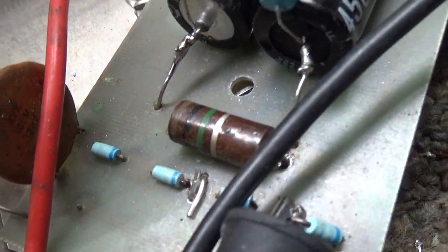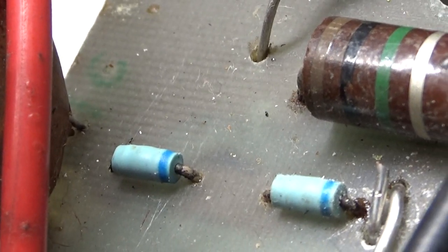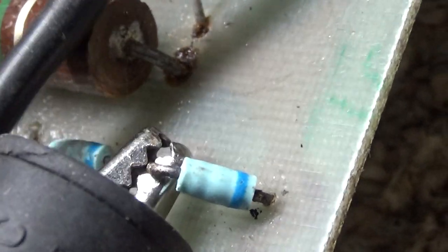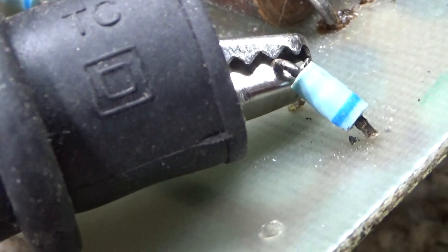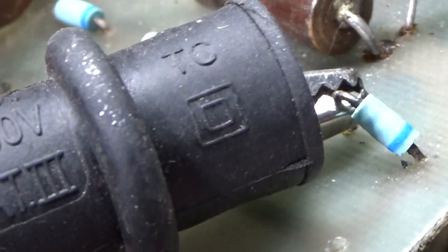those diodes are blue, kind of a bluish green if I can dial in there. It uses four of them in a voltage doubler configuration. But don't worry about the configuration. It's just four diodes in there, four of them blue ones. And I got one lead with the alligator clip. I got this one lifted up out of circuit. But normally you can test them in circuit. You don't even have to unsolder them if you can get a lead on there.